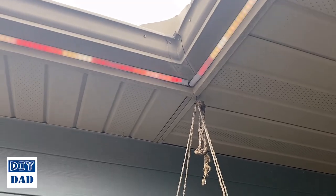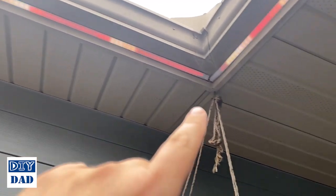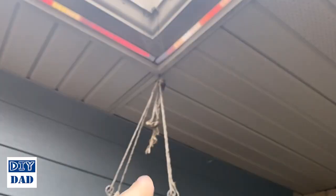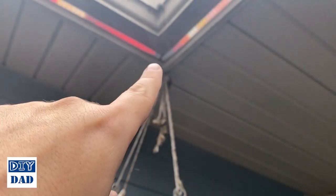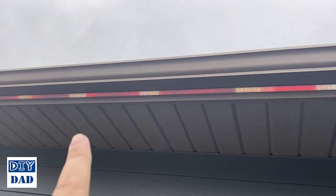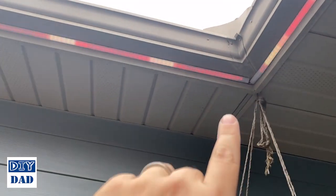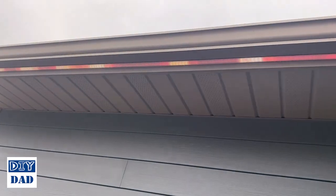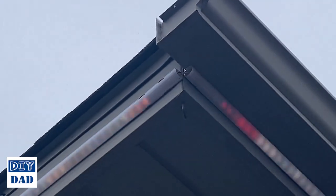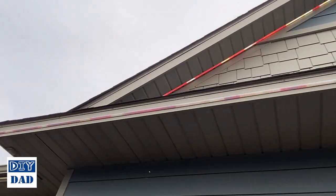This corner is where my lighting install began. There's a hole right here in the soffit and the data wire and power for this light comes out of there. The extension for my roof peaks also comes out of here going that way, and a power connection for this line is fed from there as well — so a bunch of things happened from that corner. This string of lights was installed intentionally backwards: the arrow of data travel was pointing this way so the end of it ends up here and the beginning ended up on the other side of the garage. I worked it backwards from here, got to the corner, did a splice wire — which you can see sticking there in the end of the little channels because I haven't capped these yet — and then went all the way down along the garage installing backwards as I went.